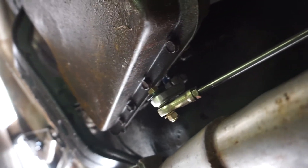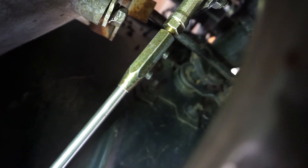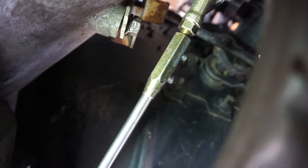We've got it quickly mocked up and it seems like it's working all right. This side is all connected and up top it's all tightened up — you can see those two little set screws, I've got those threaded down. If I were to do this again, I'd probably drop it out, drill two little spots so they could countersink in, or run two flat spots into it and blue Loctite it — but that's where we'll leave it. We'll put it on the ground and see if we actually have drive and reverse.